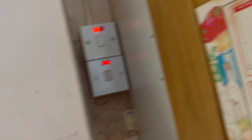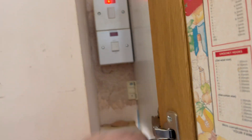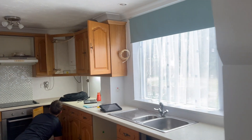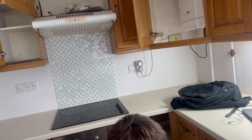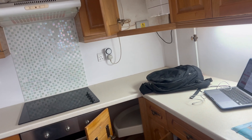We've found something very exciting as well. What's labelled as cooker is these switches here — that bottom one actually turns off the isolator in that cupboard up there where the neon doesn't work, and then the other one turns off these two sockets here, so it's an absolute mess. We're going to have to get that oven out anyway. Those sockets are on it as well.